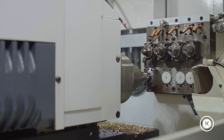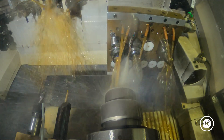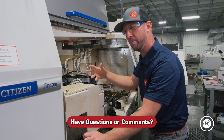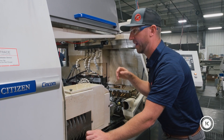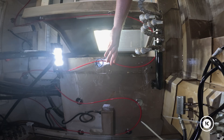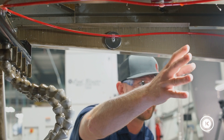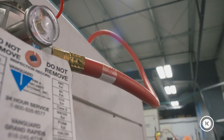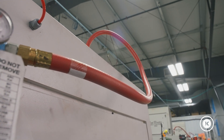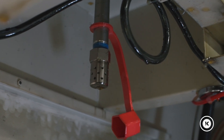We've got plenty of oxygen. And the fuel — this coolant — is generally pretty flame resistant, hard to light on fire when it's a liquid. But as machining operations take place, a lot of it starts to particleize, which adds more surface area and makes it easier to catch fire. If that were to happen, the heat and flame would reach this sensitive tube, degrade and melt it, releasing the pressure inside. That pressure holds a valve which would then actuate, allowing the suppressing agent to release into the chamber through that nozzle over there.